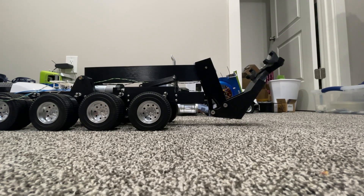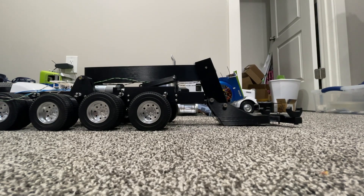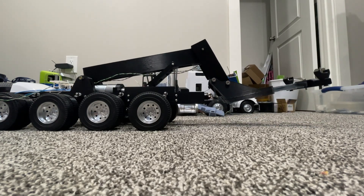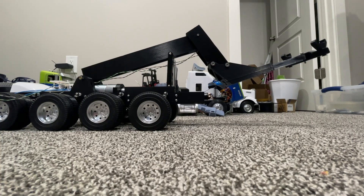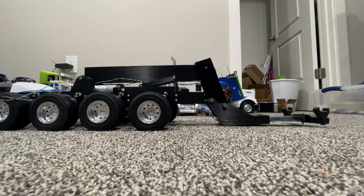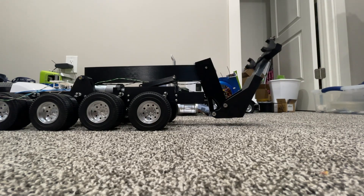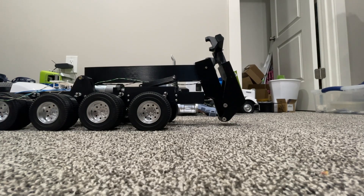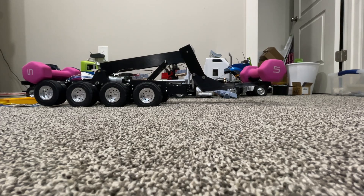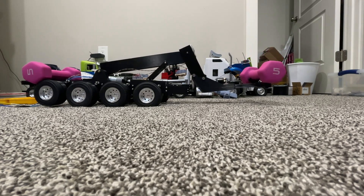Next I started working on the under-reach mechanism's fold and extend. I got everything designed up, assembled, and started testing to make sure everything would function as desired. I later designed limit switches so that you could not harm any of the motors causing the actuation. Here was another lift test at full extension, and you can see it lifts that five pound weight without any issue at all.